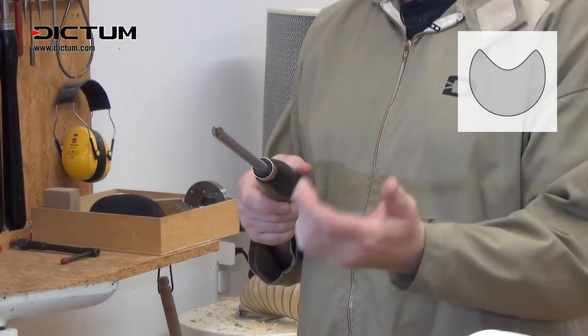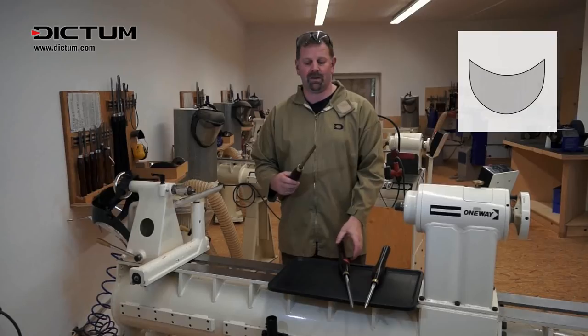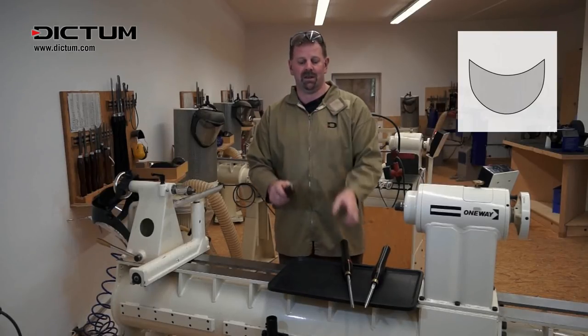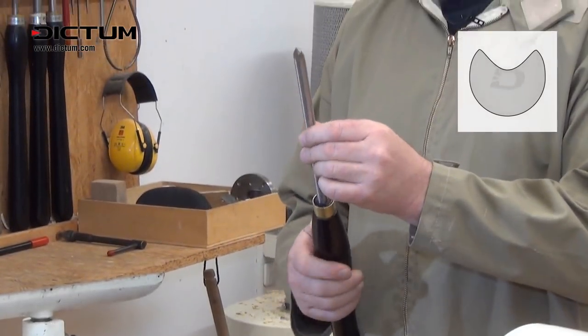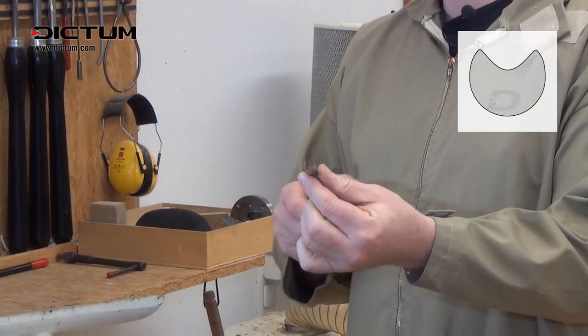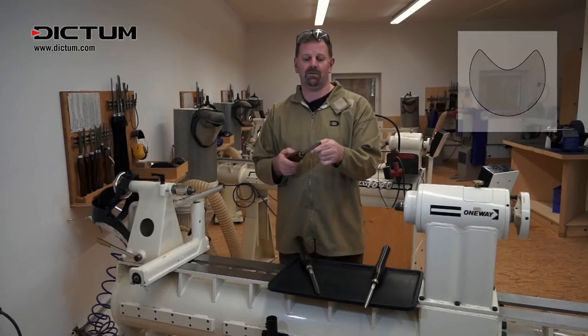Both give a slightly different grind even with the same recipe. With the squarer section we could argue that we have a slightly narrower cheek below the cutting edge, which may reach into an even tighter area. With the rounder bar we have a slightly fatter cheek just below the cutting area. With a slightly bigger stock of bar, it may be good for reaching further over the tool rest.